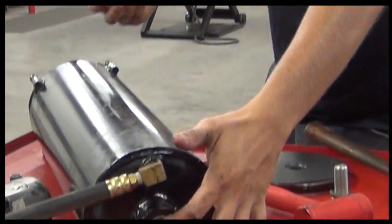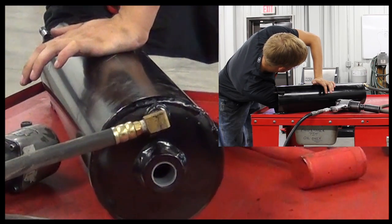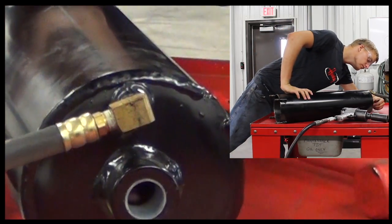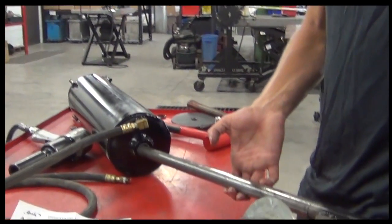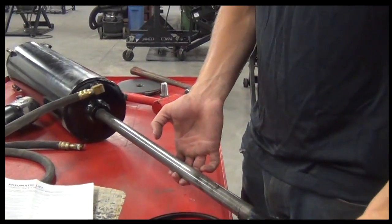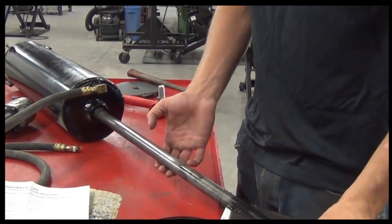The small seal goes in behind the nylon bushing and snaps in the groove in the steel bushing. The V-groove in the seal faces towards the piston. It is also important to clean and inspect the cylinder shaft for any burrs or gouges and to make sure the shaft is free from rust pits. Apply some light oil on the cylinder shaft before putting it back into the cylinder.